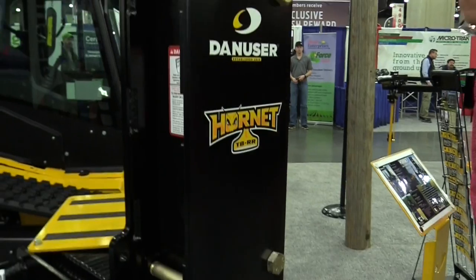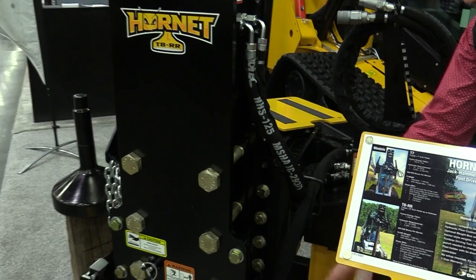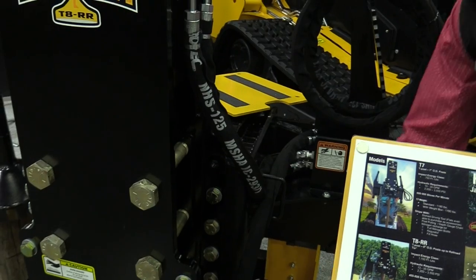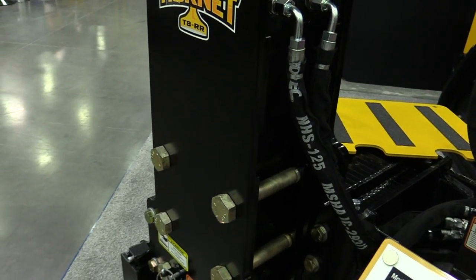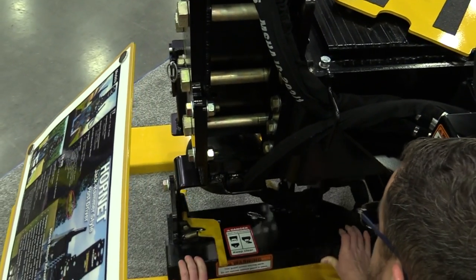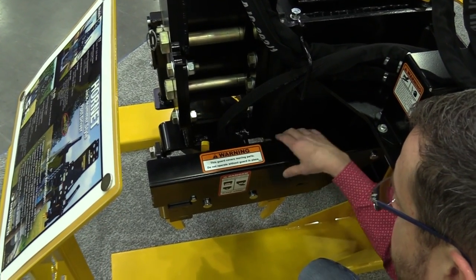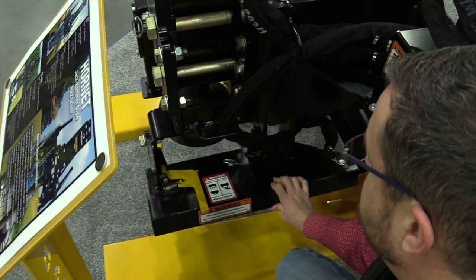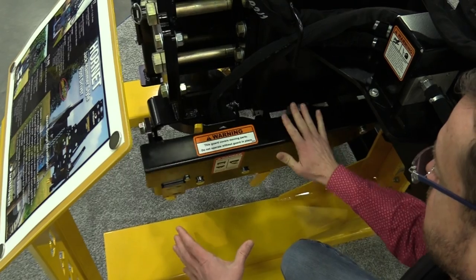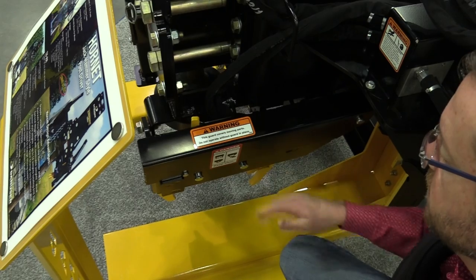On our post driver, we have the grapple option. Right now it's in the lockout feature, so this would mean you would lock it out to put it on your truck, your trailer, or just park it in general because you have a footprint here, the stand, and then the back. When you're ready for operation, you release this, and this comes up. Now, when you grab your post and you raise the machine up, it will tuck the post into the driving tool, take it where you want, set it on the ground, release the grapple, come down, put your machine to float or put down pressure on it, and then you can drive your post into the ground.